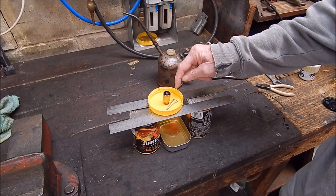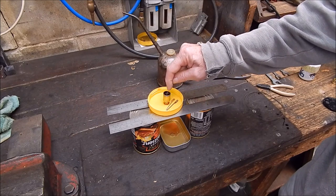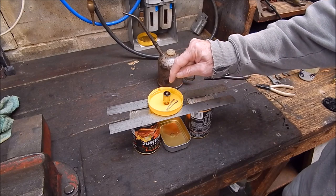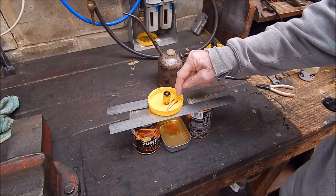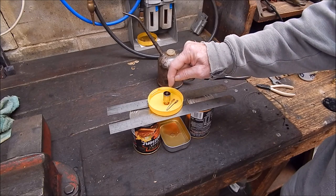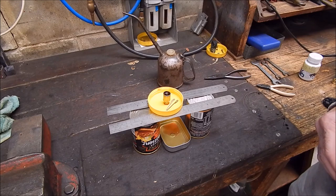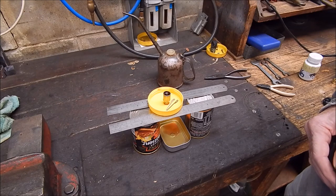Also, one of the viewers commented and said I should have mentioned this in the previous video: make your bend in the J as tight as possible so that you get contact on both the inside and outside of that feed tube, so that you get a capillary action between the wire and that tube centre, and that will aid your flow. Otherwise you might find it's too slow and may not be enough. Also, when you make up the J, make sure that the wire in the bend sits on the top edge of that tube — you don't want a gap there either. You want contact basically all the way up and all the way down, and then you shouldn't have any problems. It's a good system. Shawland used it and it works great on my old lathe. You've got that huge advantage of being able to regulate the oil flow very accurately, and basically save a lot of mess, save some oil, but mainly keep everything clean.